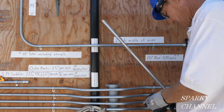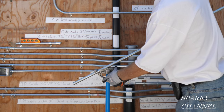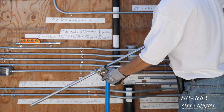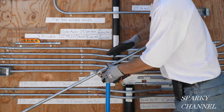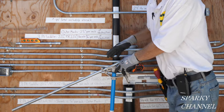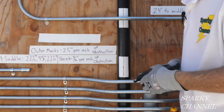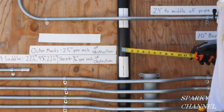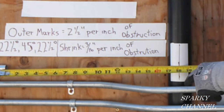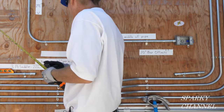What I mean by push-through is we're going to start at one end, twist it 180 degrees, do another bend, twist it 180 degrees, and do another bend — just pushing it through the whole time with your conduit going the same direction. That's the push-through method. So let's measure up: we're going from this fitting right here to the middle of this obstruction, and that's 18 inches.